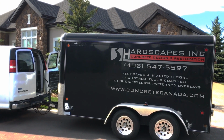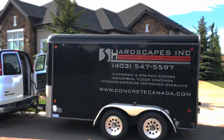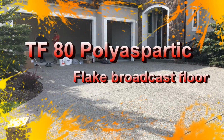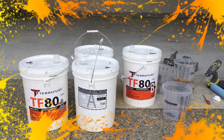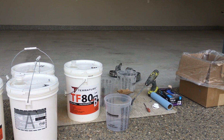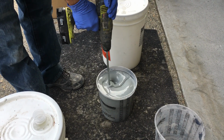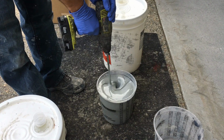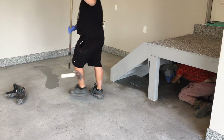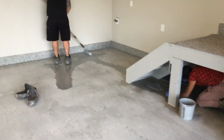Today's video is going to be a decorative flake broadcast floor using our TF80 Polyaspartic, done with Hardscapes here in Calgary, Alberta. Today's job is going to be done with our TF80 Slow in a gray colored base coat. They'll be using an 1/8 of an inch broadcast chip for this floor. It's about a 700 square foot garage that's going to be done.